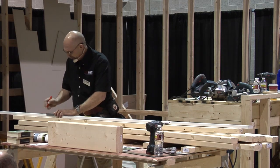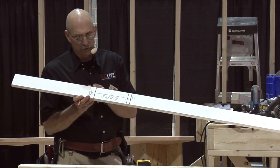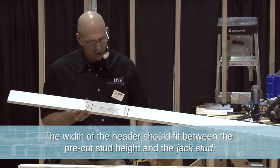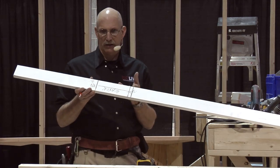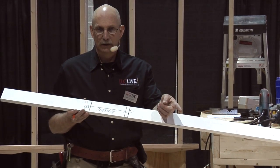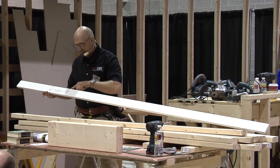So I'm going to make another mark here, and this is my header. Underneath the top plate, I have that header marked out — the exact height of it — but that only leaves me about three quarters of an inch. How am I going to deal with this? Plywood. I could get a piece of three-quarter inch plywood, and when I fabricate my header, I know right off the bat I'm going to need to put a three-quarter inch piece of plywood on top of this to make up the difference.